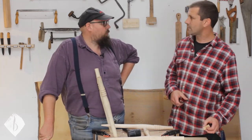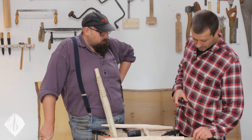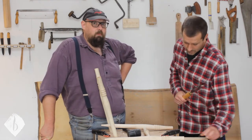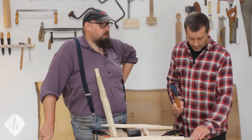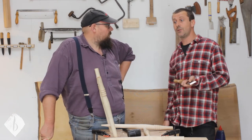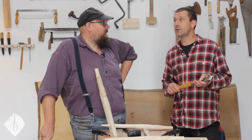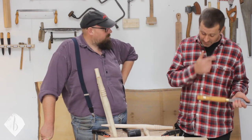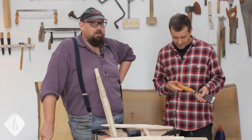Having that bulk at the top makes quite a big difference - wedges used to often snap without it. It's a theoretical 'hitting the bottom of the kerf' because as soon as you put the wedge in you open the kerf - when you feel it not going in any further it simply means there's no space for it widthways. You also don't want it long enough to send a split beyond the leg. Some say you should never saw a kerf, always do it with a chisel - but a kerf gives you space for the thickness of the wedge, otherwise you'll be snapping wedges left, right, and centre. Either approach works as long as you wedge hard.